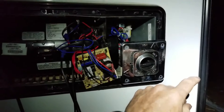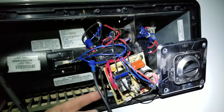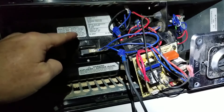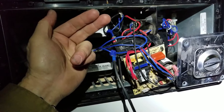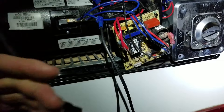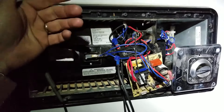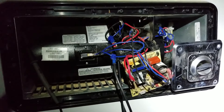We have nice warm air coming out of the furnace. Basically what's happening is 12 volts is trying to get to this control board, and it wasn't making it through the sail switch. It has to make it through the sail switch, then we daisy chain out of the sail switch to a high limit thermostat on the heat exchanger side of the furnace. It needs to go through that high limit thermostat and then it comes back to this board on this blue wire, telling the board: my motor is blowing at the correct RPM, my high limit thermostat has not gotten too hot — therefore we can support combustion, therefore turn on the gas valve. And we have another happy camper!